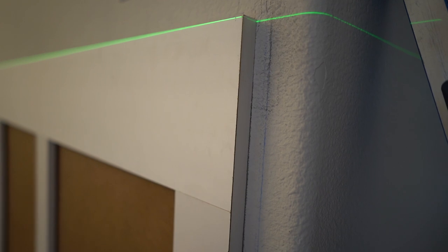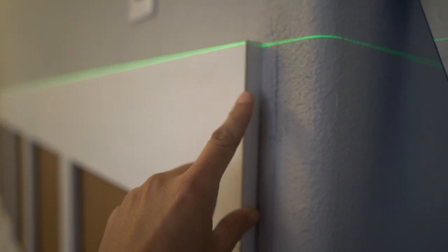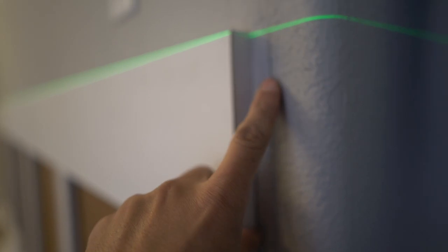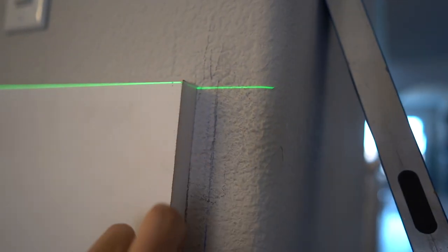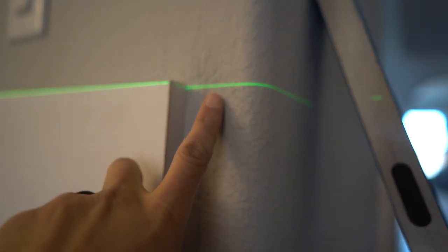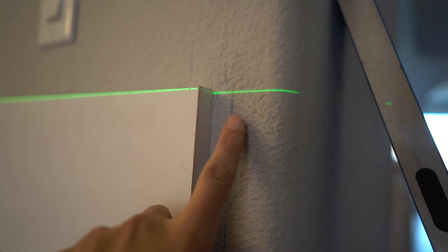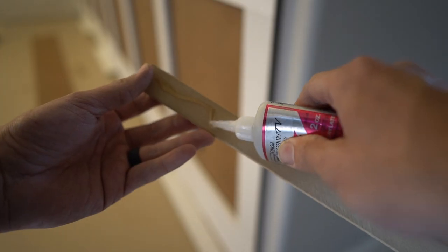Now, not only that, I'll bring my chair rail, wrap it around this little corner, and just dead end it into here. And I've made some marks here, just ignore those. That was when I was laying it out. But my chair rail will end on the flush part of this wall, and it won't mess with this bullnose.